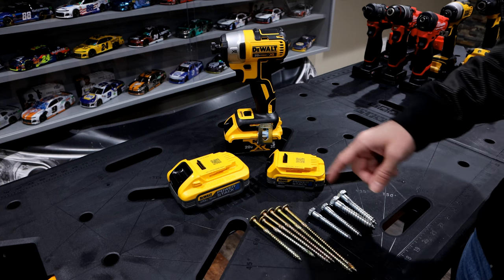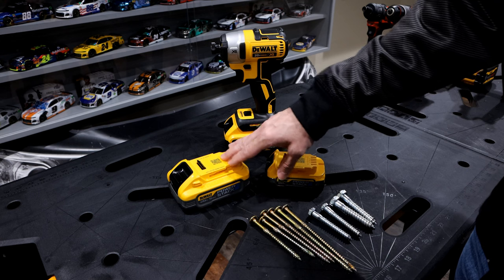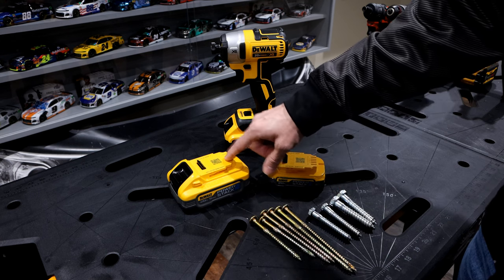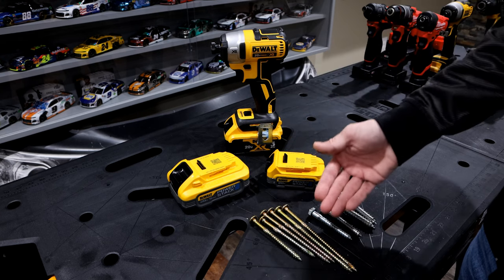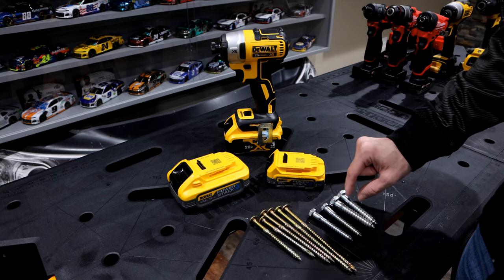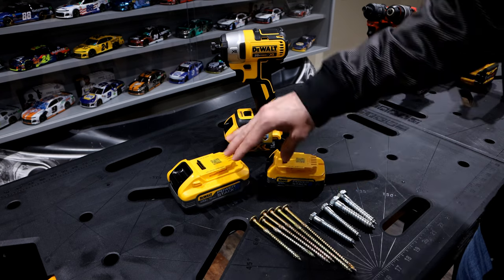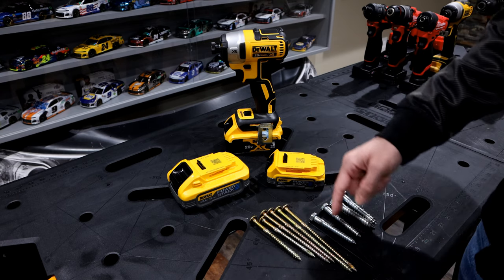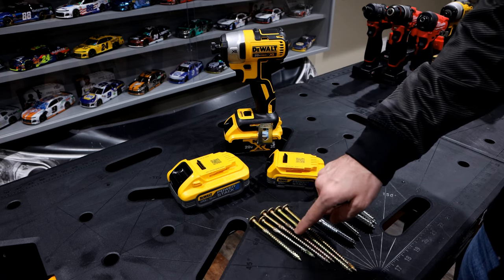So what are my final thoughts here? As you saw there in the demo, when we were using these GRK screws, each individual screw — the longer it got, we noticed that the 5.0 was drilling those a little bit quicker than what the 1.7 was. However, when we got into the smaller lag screws — and obviously these are a lot thicker, but they're a shorter length — there really wasn't any difference. I'm confident if you would have increased the size of these up to a 6 inch or so, you're going to start seeing the same trends that we saw in this group over here.